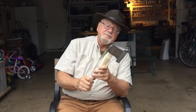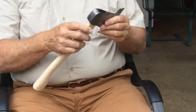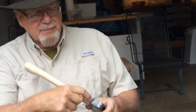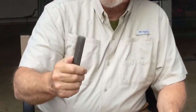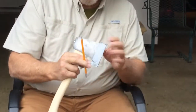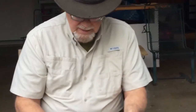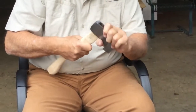That slides in pretty good. Now that I've got the end of the neck inserted inside the eye, I need to start trimming away a little bit more so that the handle neck will fit very snugly to the bottom of the eye. It doesn't have to fit snugly to the top, but I want it to fit snugly to the bottom. I can see I've got a little gap back here and a little gap up here, and it's a little too fat right in the middle. I'm going to use this four-in-hand rasp to slowly remove material until this fits a lot better. Using this pencil, I can see I need to remove a lot of material on those sides, so that's what I'm going to work on.